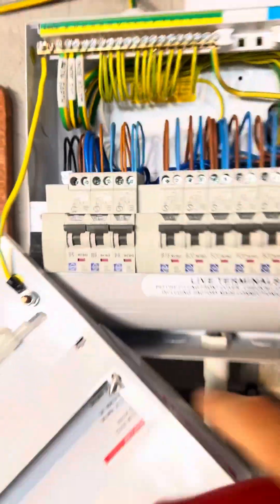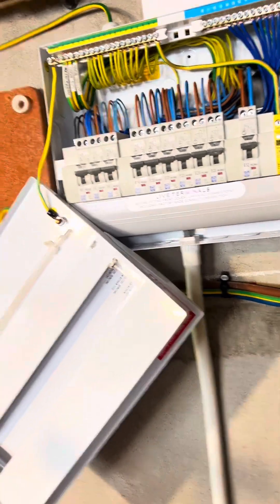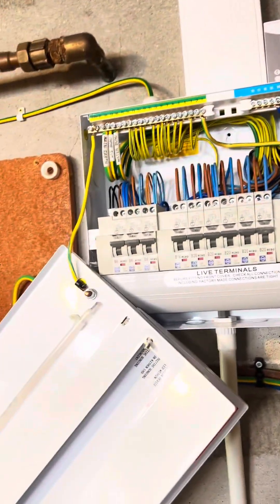When I wire smokes, I wire three-core from the board out, just in case anyone wants a later addition. If it's nearer the consumer unit rather than out in the house, you can run another three-core from the board out rather than having to link it back into the system.